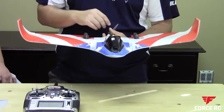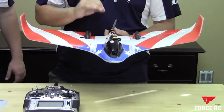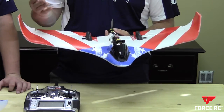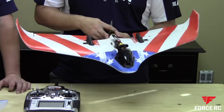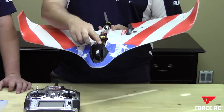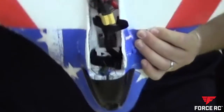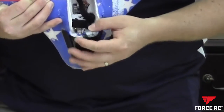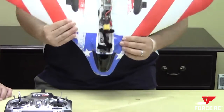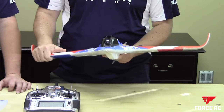We had to run certain VTXs at the event, so we ran the FXT Musketeer — it's an adjustable power output VTX. It's got super crystal clear video, and being able to adjust between 25 milliwatt, 200, and 600 milliwatt is really handy. We ran 200 at the race, but if we wanted to fly anywhere around Hawaii, we could bump it up really easily. It's also got pit mode so you can leave the VTX off while working on it. We also ran VAS antennas — the air screws and race spec stuff. We actually undid the heat shrink around them and wound everything up inside the canopy, so anything that was any drag at all we hid inside the canopy. Just cleaned it up as much as possible. They served us really well — we never needed our backups.